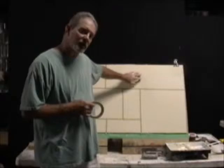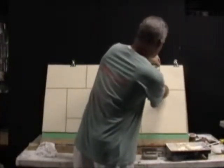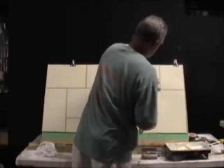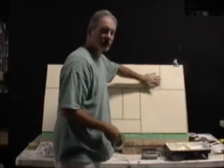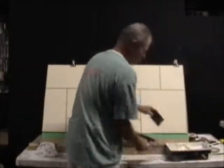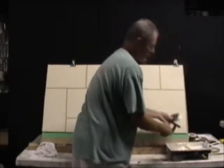After the background is dry, we're going to use a narrow tape to resemble the grout line. I'll finish my last piece of random stone here. The tape is applied and usually just torn with a finger. You can also use a razor blade for a finer cut. We're going to take some quarry stone and apply it with a trowel rather than a roller.